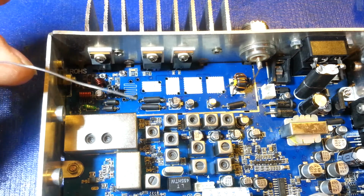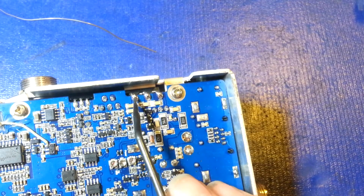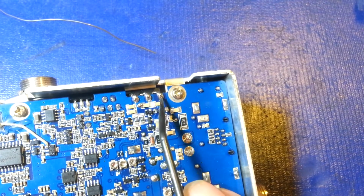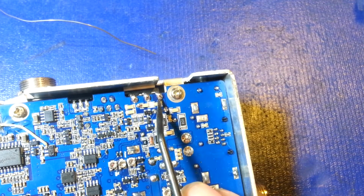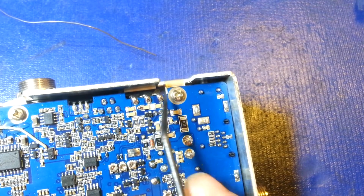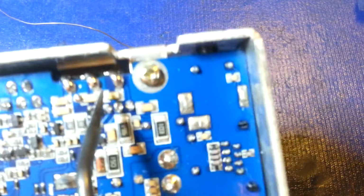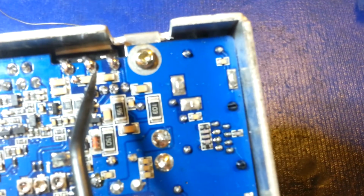I can get beautiful, well, matter of fact, I can show you, actually reflowed these three solders. Well, actually I did not reflow them, I should say. These were nasty looking too. Big balls, they were white, very crystalline looking on the structure, and that's not what you want to see. That right there is what you want to see. If I can get it to focus that close.